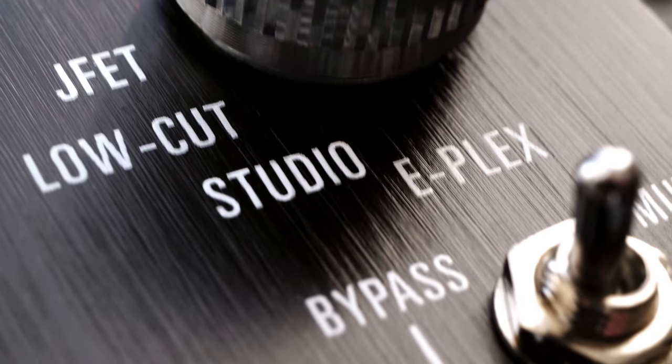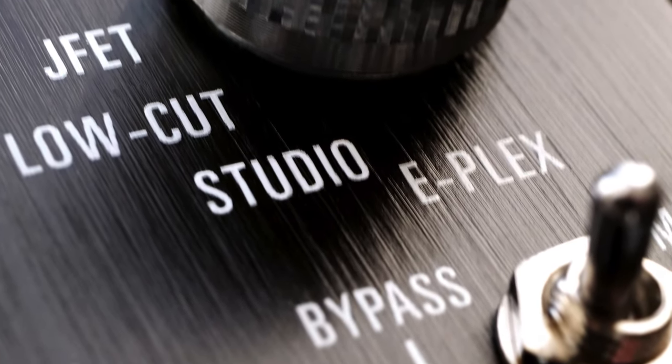The studio mode on ZIO is based around this trick, so it allows you to take a little bit of muddiness out of the signal around 300 hertz. It also takes off muddiness from the very low end by using a bit of a high pass filter. And it gives a nice presence boost in the mid-range by creating a little bit of boost around the 4K region, which goes all the way to 1K and then above. This is carefully balanced so that it doesn't give you an ice pick type attack, but it brings out clarity and lets you be heard better in a mix.